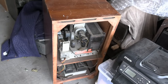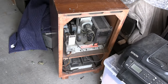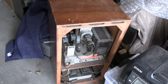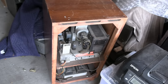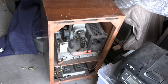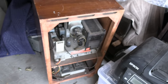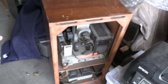You've got it home safely — now what? You want to check it out, pull out the chassis. I would not recommend just plugging this into the wall. If you have a dim bulb tester and keep an eye on it, you can. I generally don't bother, because I know I'm going to restore it — I know it needs work. The previous owner told me his dad or grandfather had tinkered with it, and I have no idea what's going on underneath the chassis. It'd be nice to verify that a few things work, but we're going to find out as we work on it. If you can coax a raster out of it, that basically tells you the flyback, power transformer, yoke, and picture tube are all good.